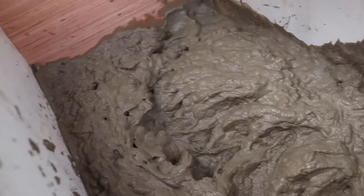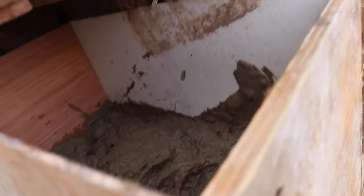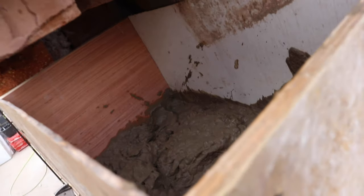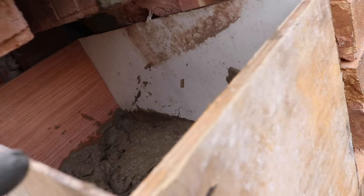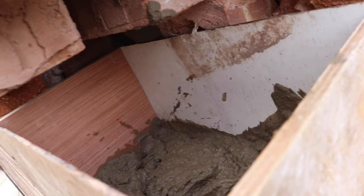I'm standing on a rickety set of trestles and we've just put the first bucket in. As you can see, that's gone in quite nicely and into all the corners — I've pushed all the air out. The plan is to bring it up to about halfway, figure out exactly where I want to be, then drop the reinforcing bars in and continue to the exact level I want.